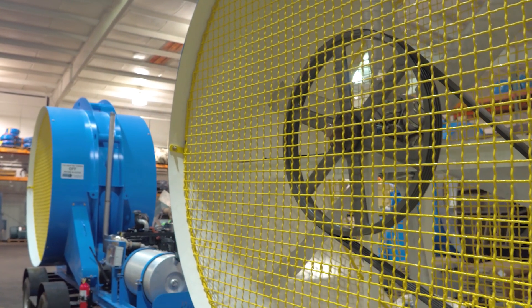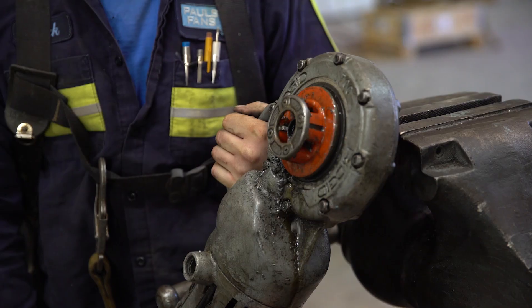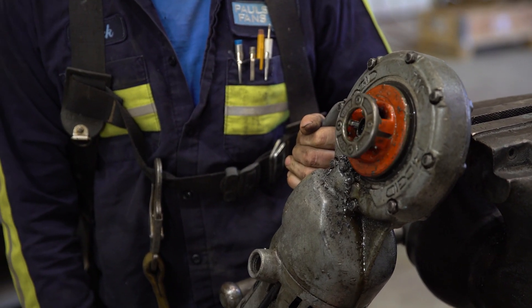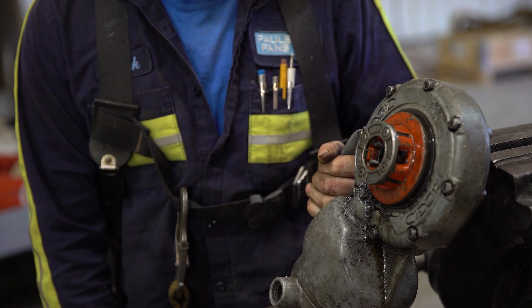I do shroud stresses, shaft stresses, and blade deflection, and we also do a burn analysis. Once the fan is completely constructed, we test it, balance it, line it up, then I send my guys out to install it and commission it to ensure it's running properly.